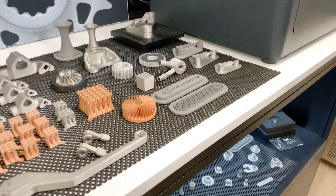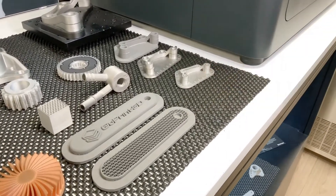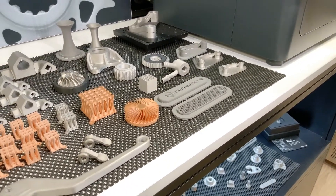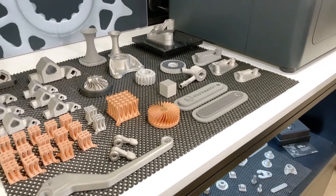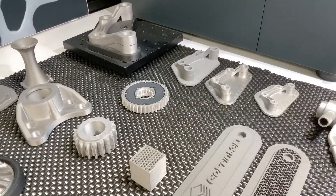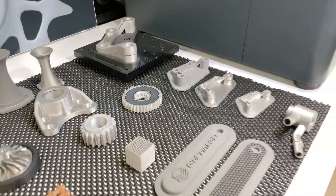What we do is wash that out. As you can see from some of the parts here, we've got the green stage and then the fully sintered parts. We shrink the part down by 17% in the furnace. The software controls all of that with a 20% uplift in the part once it's put into the printer, ready for printing. We've got the outer and inner printed in 17-4 stainless and the actual weight saving comes from the composite material.